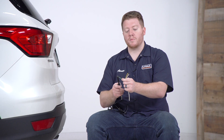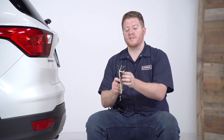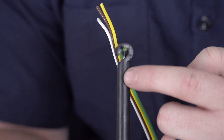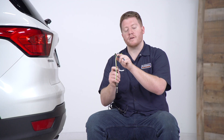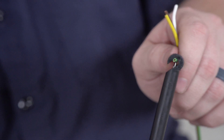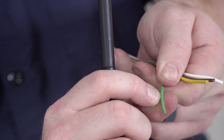So you're going to take your wire and you're going to place it into the cap of your circuit tester, and you're going to line it up where the tip of your circuit tester is in the middle of the wire. Now if you made sure that your tip was sharp, you just have to put a little bit of pressure in for the tip to barely pierce the wire to find a current, and it really won't take a lot of pressure.